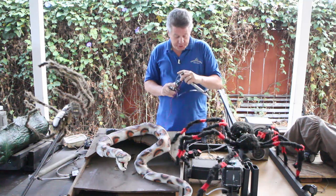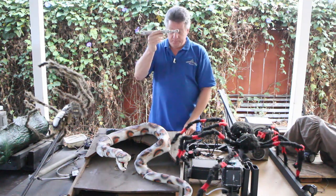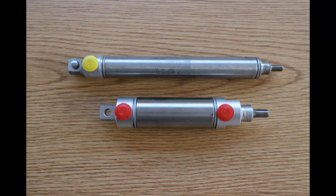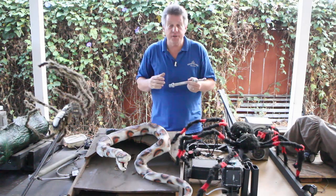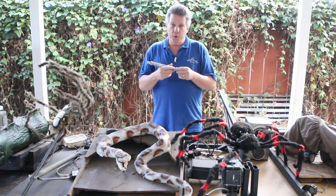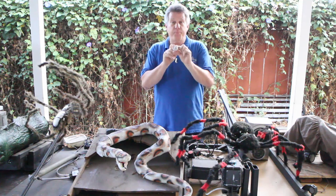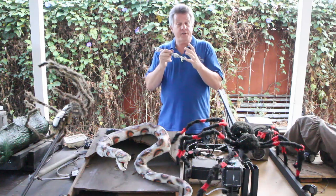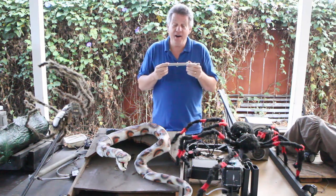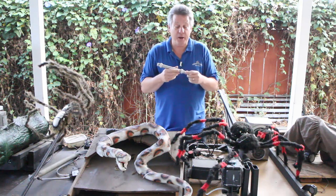You're going to have your lines running over to your cylinder. Cylinders come in a wide variety of sizes and shapes — little tiny ones, bigger ones. There's an 18-inch here on the Leaping Spider we'll look at a little later. A couple things you're going to hear talked about when you go looking at cylinders: stroke — that's how long of an extension the rod is going to make — and bore, which is how big around your cylinder is. The bigger it is, the more air it's going to use, the faster it'll go, the more power it can lift. The bigger ones are usually more expensive and they do use more air, so you don't want to use one bigger than you need. But I always try to overbuild a little bit to allow me to add some weight to my prop if I need to.